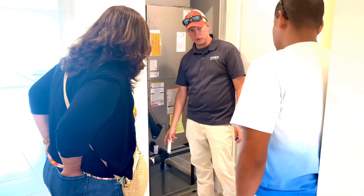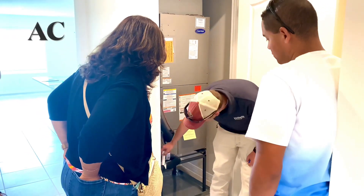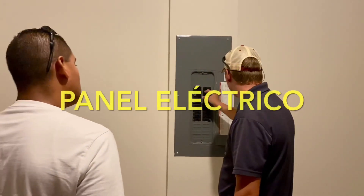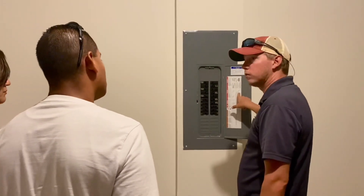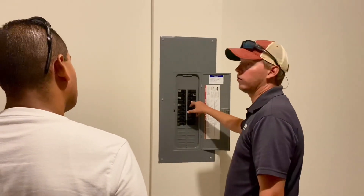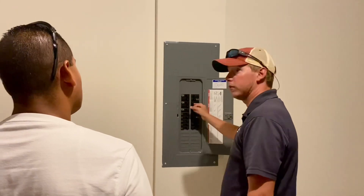So you're going to pour one cup of vinegar right here once a month. We're missing two of the filters — here's the door, your filter goes right here. These two breakers are off right now because we don't have the range installed, so we don't want to leave that big panel sitting there open. Same thing with the dryer — you don't have a dryer installed, so when you get the dryer installed, just come out here and flip this on.